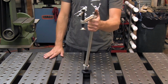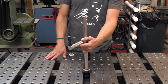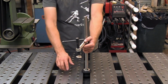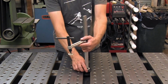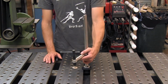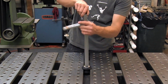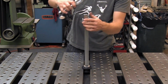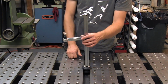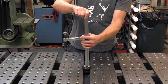These are the 360-degree clamps, and the thing I like about these is sometimes I need to clamp something that the other clamps just don't quite hit perfectly because they're on a grid system. And this one I can actually move outside of that grid system and get in the exact location that I want to be at. It also has a little key here that you can depress and flip the clamp over and use it to push or lift upwards. So all the clamps you can do that. I just happen to use these a little bit more in that configuration.